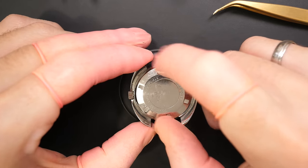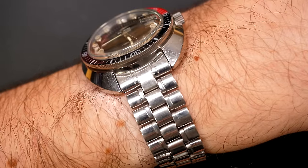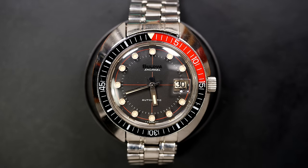That's it — putting it on the timegrapher. The amplitude is around 250-260, a bit higher than before. Not a lot higher actually because the movement was already quite clean. The beat error was already good, and just regulating the watch — around zero, oscillating between plus four and minus two. The watch is quite accurate and the amplitude is quite good. I'm pretty pleased with the result. It's looking much nicer than when it came in, especially with the repolished crystal. Nice result. Here is the watch on my wrist — much nicer. I didn't touch anything on the case; it was already looking very nice and I wanted to keep it as original as possible. Hope you like the video, hope my patron will be proud and will wear and enjoy this very nice watch. Thanks a lot for watching and I'll see you in my next episode — bye!